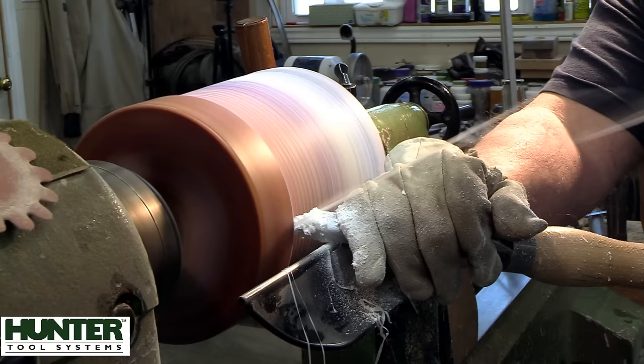And anyway, once that's done, we'll be able to figure out exactly how we're going to drill a hole in the bottom of this. I need a little area for the cord to come in and not be kind of bound up, so it's important to have a little relief hole. But of course, now the center's gone out of this. So if you try and use a Forstner bit, there's nothing for the center point to grab hold of, and it's very hard to do anything with it. So that was my solution: just drive a dowel down into it, and now the center of the bit is supported, and you can drill it out. And there you go. We're ready for the cord.